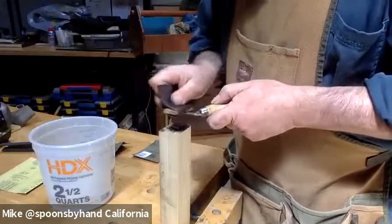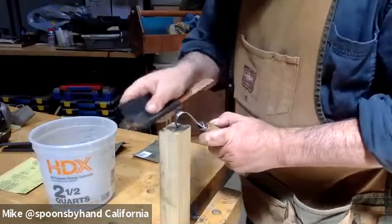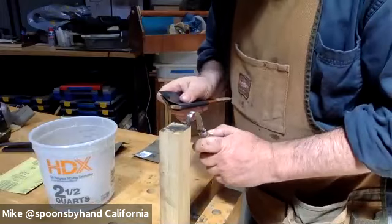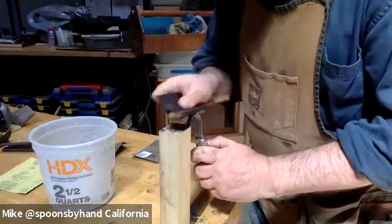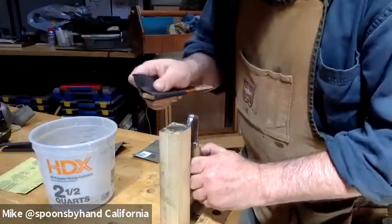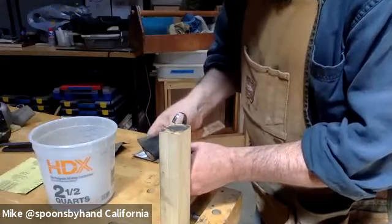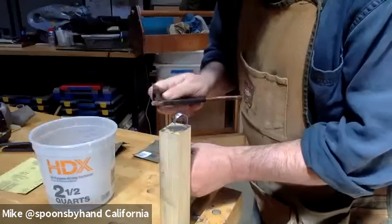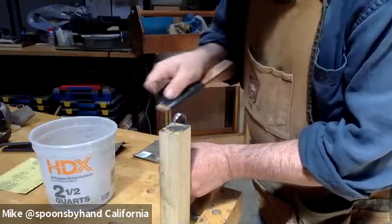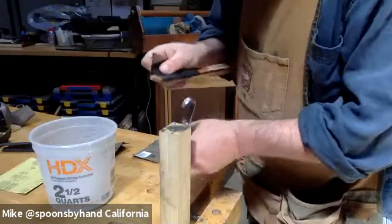Okay, 1,500 grit. So I'm making a mess. This is another thing that's helpful to me, at least when I was new to sharpening, but it still remains helpful: when I'm on one grit for like an hour, I remind myself, no one who knows what they're doing spends an hour on this grit. Like I'm doing something wrong. Yeah, if you're spending an hour on that grit, you should have spent 5 minutes with a rougher grit first. Right.